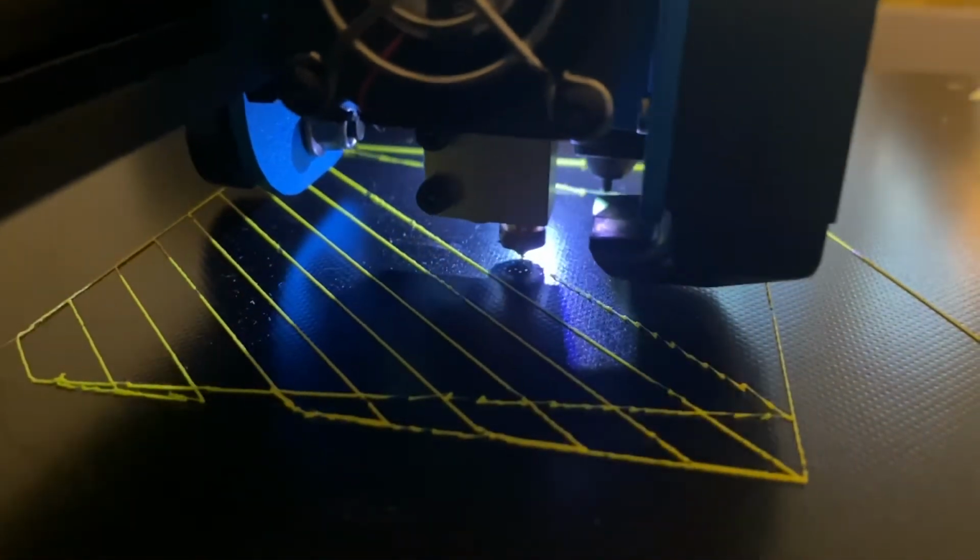And so the first thing you usually look out for, if whatever you're printing is not attaching to the print bed, is you make sure that it's clean. Use some rubbing alcohol, try again. Doesn't work? Okay, then that's not the problem. The material I'm printing with is actually cold bed printing, so that means there's no bed temperature, which means that cannot be the issue. When that isn't the case either, you start looking at, okay, well maybe my bed isn't calibrated. Fair, check that out.